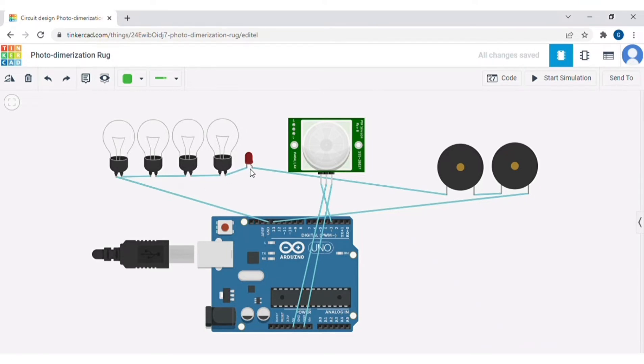Then, for the UVC light bulbs and one red LED: we connected the PIR sensor's ground to the ground power, its power to 5 volts, and its signal to pin 3 digital PWM. Then, we connected one piezo buzzer's negative terminal to pin 13 digital PWM and its positive terminal to the negative terminal of the other piezo buzzer. The other piezo buzzer's positive terminal is connected to the anode of the red LED, and its cathode is connected to terminal 2 of one UVC light bulb. Terminal 1 of that bulb connects to terminal 2 of the second bulb, the second bulb's terminal 1 to terminal 2 of the third bulb, the third bulb's terminal 1 to terminal 2 of the fourth bulb, and the fourth bulb's terminal 1 is connected to the ground digital PWM.